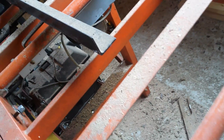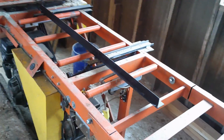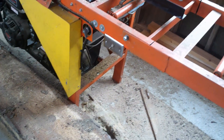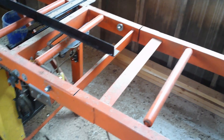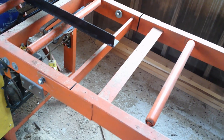The wires are attached here and then go into this box right here. That box distributes power to everything else on the mill, so there's one central location to go to in the event that something isn't working. In addition to that, there's also an extension cord, because I used to have a 12-volt chainsaw wired to plug right into that cord so it would be the end-cut saw for the end of the boards.